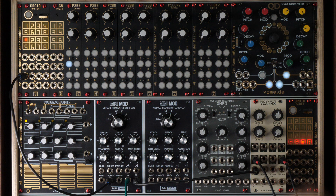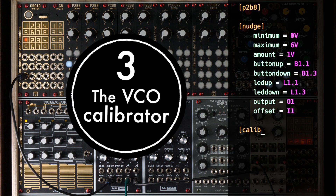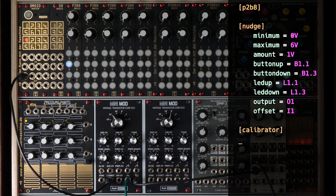The solution to this is the calibrator circuit. This is very easy to use — we just pass the pitch CV through input and output. On O2, an adjusted pitch is generated which compensates for the errors of the VCO. So as input, we take the pitch that's available at output 1, and the calibrated output goes to output 2. Then we add two buttons — for example, button 5 and button 7 — for adjusting the correction.